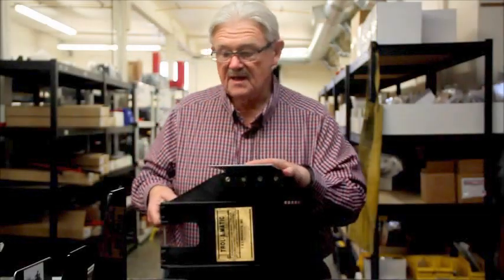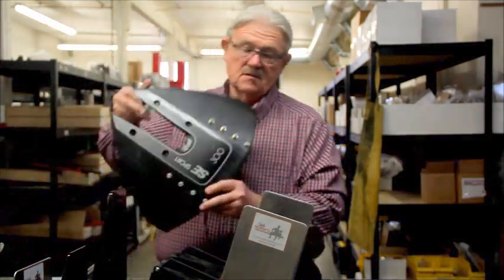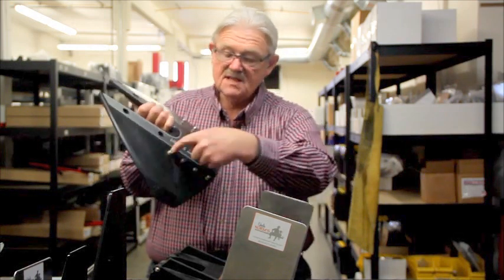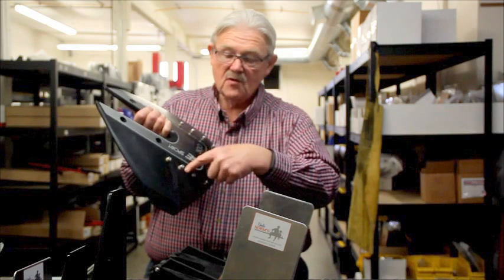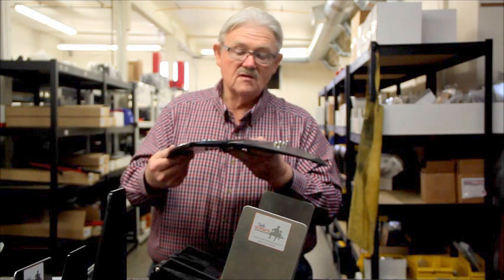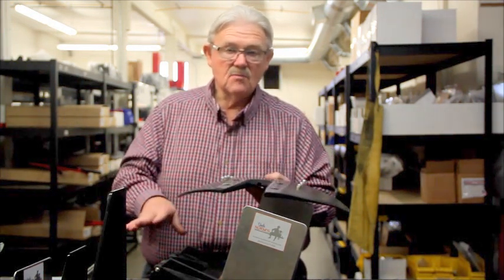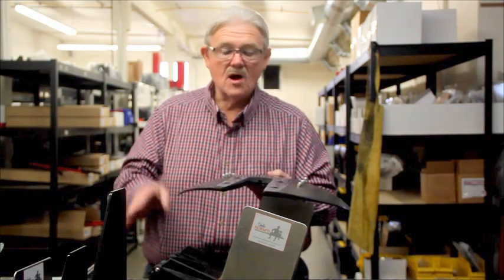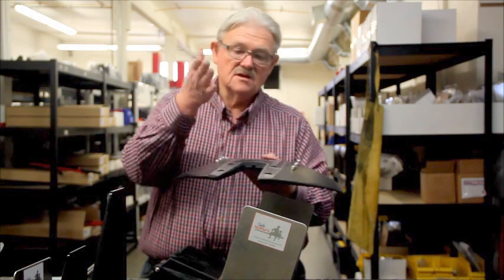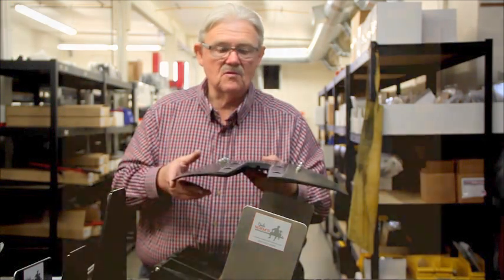The troll plate fins are the exact same fins we use for hydrofoils. We drill holes through the hydrofoil and bolt the fins on, so now you're going to have vertical fins on the hydrofoil that will be active when the boat is low and slow and the motor is down low in the water. As you come up to cruise speed, the fins are going to come out of the water and not be holding you back or adding a lot of steering control.